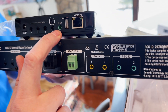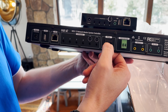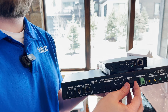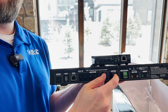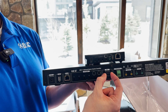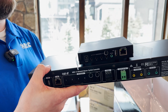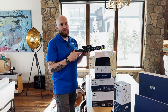We have one RS-232 on the 5, and as you go to the 12, it adds an additional one in there as well. We also have relays added, so we can wire up relays and contact closures built right in. What do you use a relay for? This would be like a traditional doorbell — let's say someone hits just the old standard doorbell, we can wire that to the relay and the control system can identify that somebody's at the front door. Once it knows the doorbell's been rung, there's an unlimited amount of things that can happen in the home — between our HDA products, our audio distribution, lighting. You can have lights flash, if you don't want an audible tone — all sorts of cool things you can do.